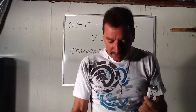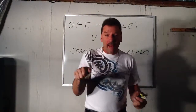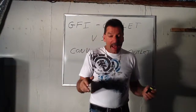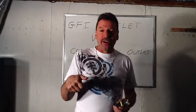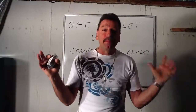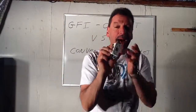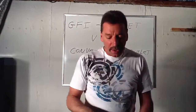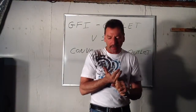They sense that and stop the electric flow immediately. As you're doing your egg beating, making batter for a cake, all of a sudden it stops beating and the electric goes off and you start cursing out the outlet — meanwhile it probably just saved your life. That's what the GFI is for. They pop for other reasons also, but that's the main reason. They come in different amperages — 15 and 20 amps — so be careful what you buy.